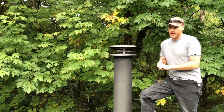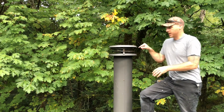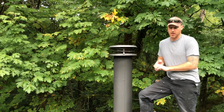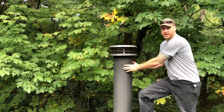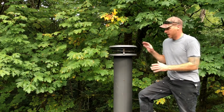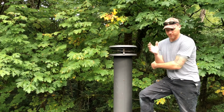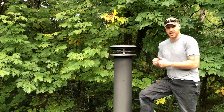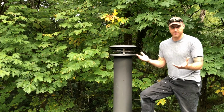So, and that was about 3 cords of wood worth of material that you saw on the inside of there, and then actually at the bottom of the fireplace too. I never had to clean the fireplace out once. So either I was burning super hot, or it was all just being caked on the duct. But either way, that was really easy to clean the inside of the flue. It went all the way down to that flue valve on the bottom there. So let's go on the inside, let's clean that out, and then let's put those baffles back in, and then the job's completed.